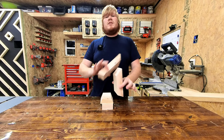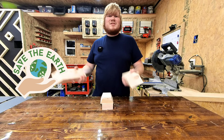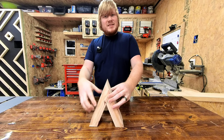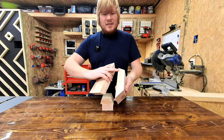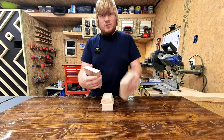Let's say you wanted to go completely rogue, take my plans, crumple them up, and throw them in the trash — why did you print them in the first place? If you just want to build this tree at any size, any thickness of wood: cut your first angle — it could be 45 degrees, it could be 30 degrees, it doesn't matter. Cut your first angle, and the total length of your piece plus your mitered thickness gives you the second. At a 45-degree angle with a 2x4, that comes out to exactly two inches — math. So this piece is 6.5 inches, and the other is 8.5 inches, giving you a perfectly married-up piece with a nice, perfect little peak.